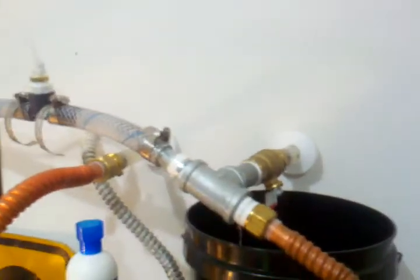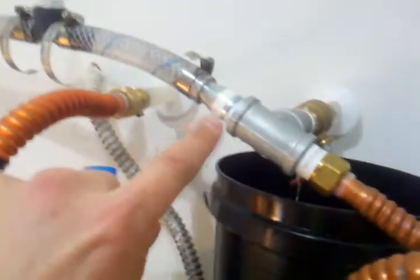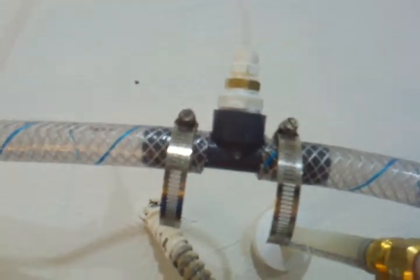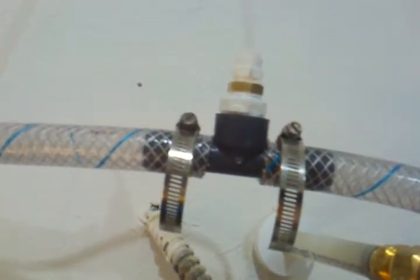It all starts over here where I added a water supply to the RO unit. You guys remember my previous videos — I had been getting my water supply from the house right here at the water heater. So we just added this T in here, put this barb fitting in here. And today I just bought this unit right here — barb to barb, three-quarter to half-inch brass, which is a half-inch to one-quarter. It's the only way you can go down, and then just a quick connect to run our water supply over there.